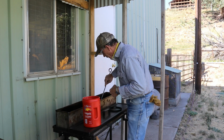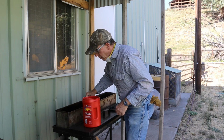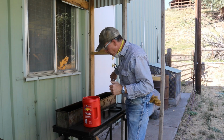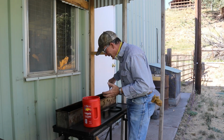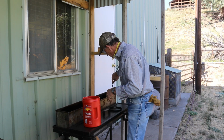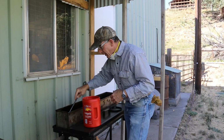One of the things that's really important about this bluing process is that we control the heat in this bluing tank in a very narrow range. So if we've got this exothermic reaction going on at the same time we're heating the tank, as soon as that reaction gets finished, then we lose all that heat, and our tank's temperature is going to drop, and it's going to cause us all sorts of problems. So we'll continue here. We'll get this thing all mixed up and get it cooled back off, and then we'll come back and start heating our tank up.